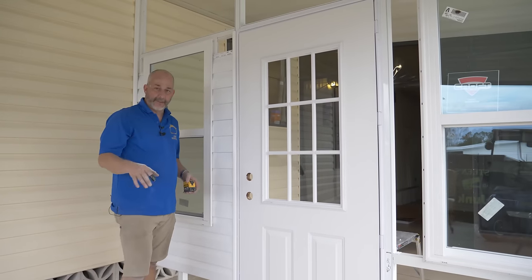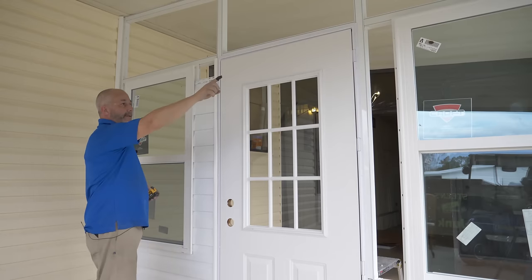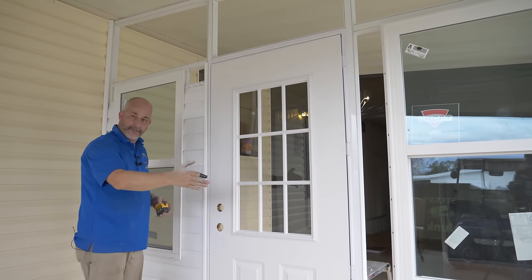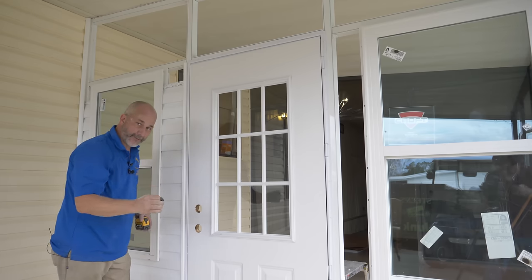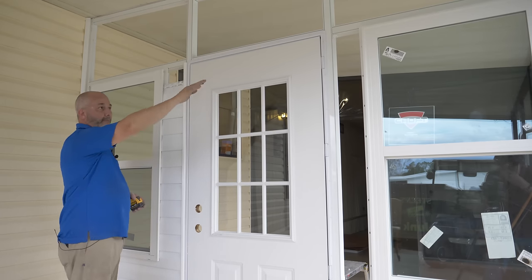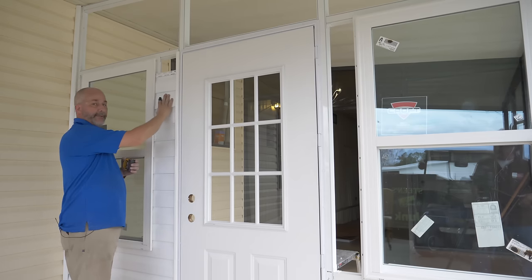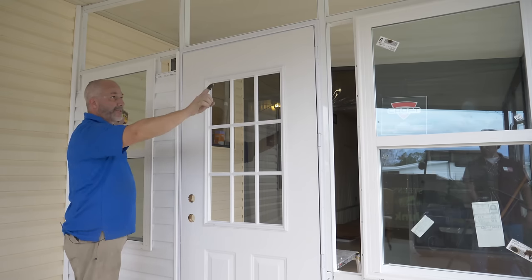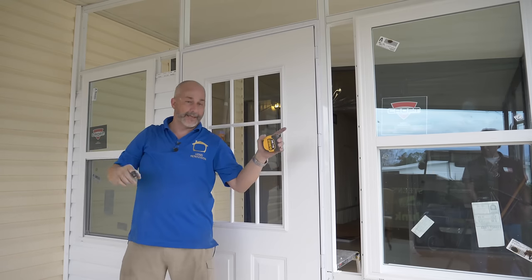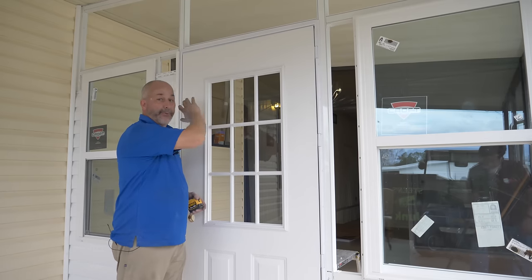In the interest of time, I'm not gonna get too fussy. I'm gonna cut one piece of siding all the way across to pick up all of the verticals, okay? Because we started at the same horizontal line off a laser, we'll be able to finish within one horizontal line, give or take a millimeter or so, right? And we have all this flexibility, so it doesn't matter. That way we can connect all the top with one piece of siding, because it's 11 and a half feet, they come 12 feet in the box, and it's gonna look absolutely beautiful. You're gonna look like a pro.